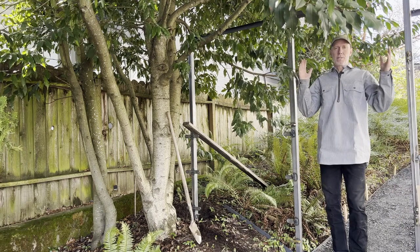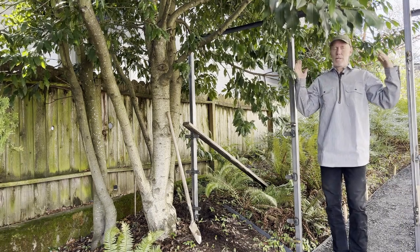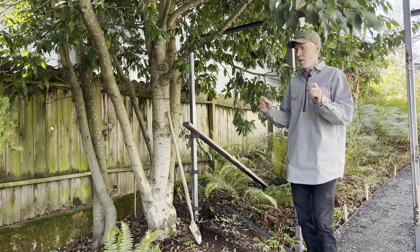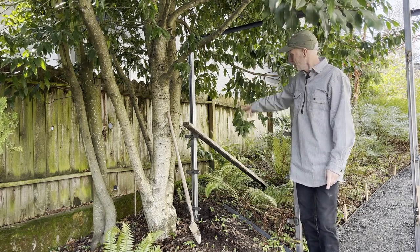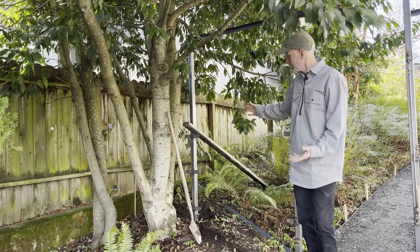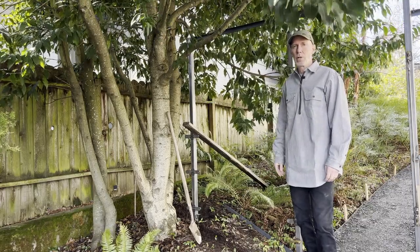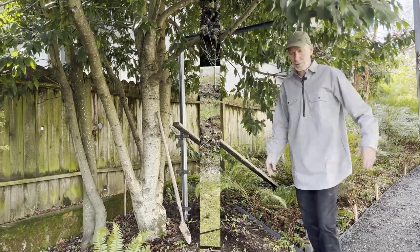All right, so a surprisingly small amount of push from that side squared this thing up and actually got me slightly overcorrected, but I think that gate's gonna droop a little bit. So that's in good shape and I can adjust that by just moving those holes a little bit on that last piece against the wall. So now this post is all braced. It's string lined and planar, plumb and everything. So I'll go ahead and put the concrete in and then I can let this sit tight. We're supposed to get rain again in the next few days, but at least for now, get it started curing and then I can work on the infill panels and get the other stuff done.